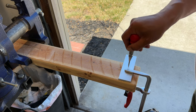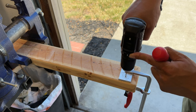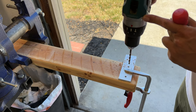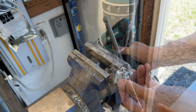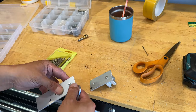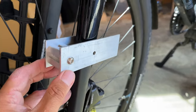I wanted the plastic cage to attach using metal brackets. I used my calipers to mark the hole spacing of 1.75 inches, using a center punch to punch the hole, then a pilot drill to drill the hole. I have more drills than I know what to do with so I just keep different sized bits and deburr tools in various drills — makes quick work being able to swap tool to tool. I'm using this piece of item extrusion as a spacer to match the thickness of the fork. I'm doing a trial fit here to see if I have my spacing right and it fits beautifully. Even with no fasteners installed it feels pretty solid, there's no wiggle.